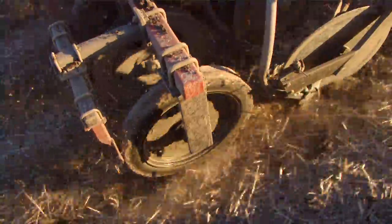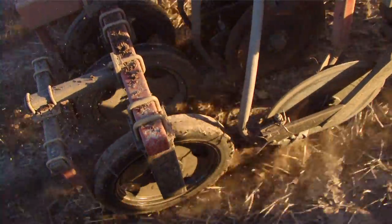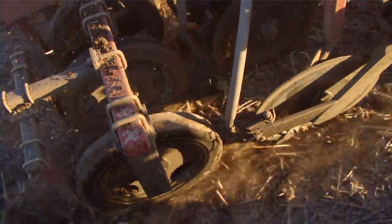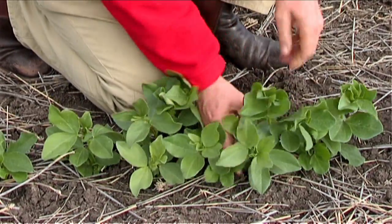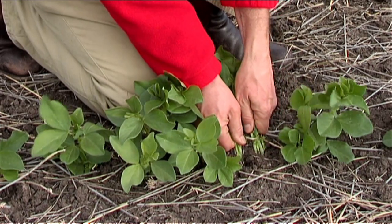The conditions were very marginal, so the disc machines lose less moisture and they place the seed more consistently than tine machines — that's why we're using them. You could probably place seed within one centimetre of depth consistently, whereas tines are all over the place. You can get them reasonably good, but they just lose a lot more moisture.